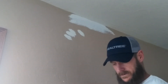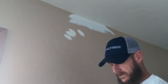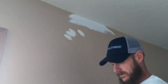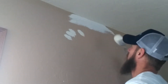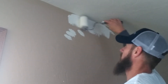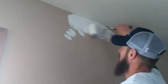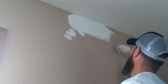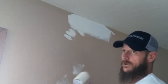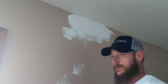And there you go. If I were doing this for real, this is where I would take my 4-inch roller and just back-roll as close to the ceiling as I can get without hitting it. It makes it a little easier to fill in when you come to roll with your 9-inch roller. But you don't need it — that's just how that goes.